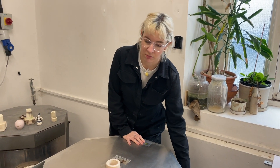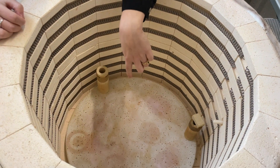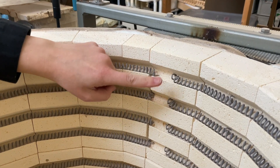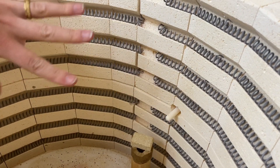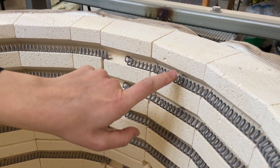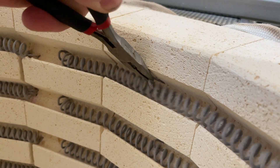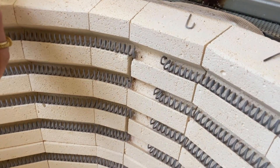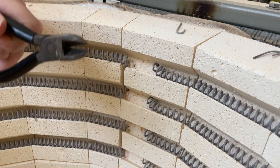We're going to open up and have a look inside. I don't know exactly what's wrong, it's just not working properly. We need to remove this kiln shelf and these props, then actually get rid of the elements. We've got the top bank with the brown, the connection, and the blue, and then the second bank with the brown, the connection, and the blue. We also have these pins — we're going to need some pliers and we'll just remove these pins. Then we're going to use the brittleness of these elements to our advantage and clip them one by one, doing a little wiggle test on the other side to make sure we're in the right place.